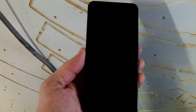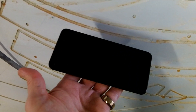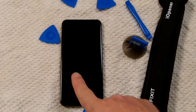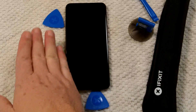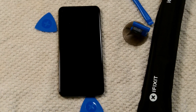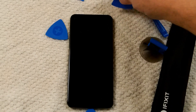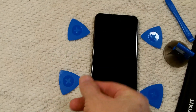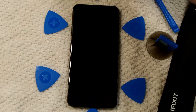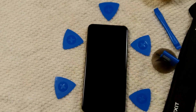So I'm going to have to take off the glass front, extract the motherboard, and reflow some components on the motherboard. The wires are on the left side here. We're going to be opening it from the right side up, like a book. There are some clips in here, so we're going to be putting these pry tools between the clips in these general locations, and then unclip them to get the whole screen out.